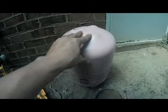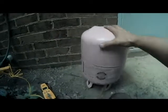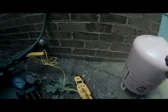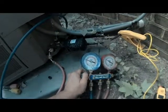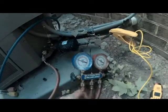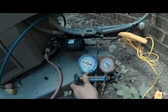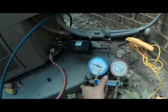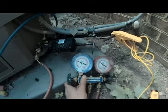We'll start charging this unit up with R410A. One thing to note: on R410A you always want to charge in liquid form, so you turn the bottle upside down. We're going to let liquid in on our low side. This will raise both our pressures. Typically on R410A, I'm looking for about 125 on suction and right around 300 on the head pressure. Let's go ahead and get this charged up.